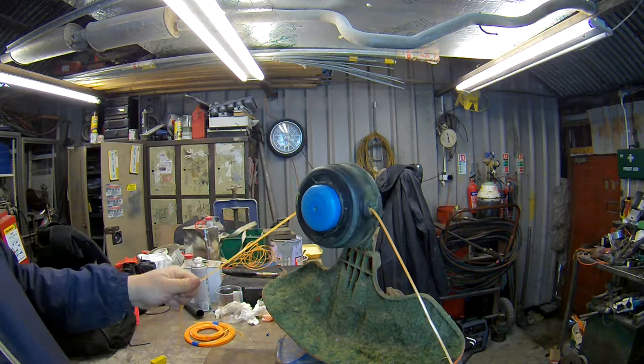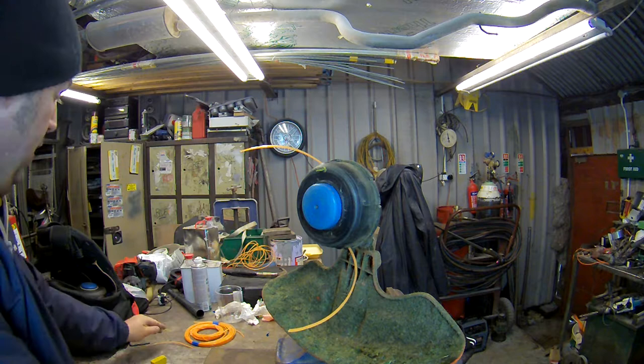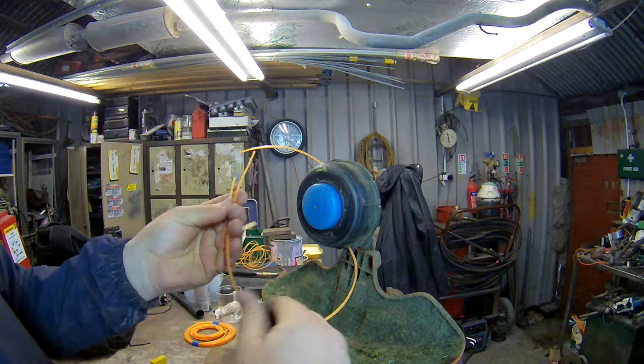Putting it back on is simple. If you want more line sticking out, just pull it. If you've got too much sticking out, just wind it back in. See the two notches - line them up over there and just push like that. You've got to line up in the centre to get on the cogs and push on - that's it. Give it a quick pull, give it a press to make sure it's working. Then I trim it to size - it'll self-cut anyway. That was four meters with that much waste - I could have got away with less.